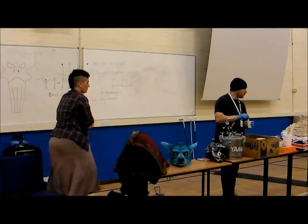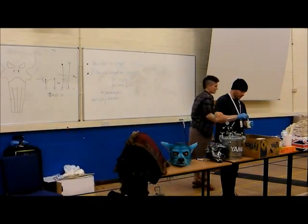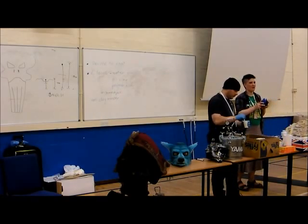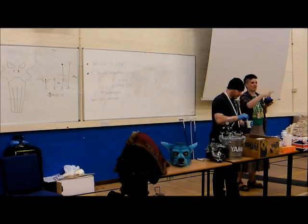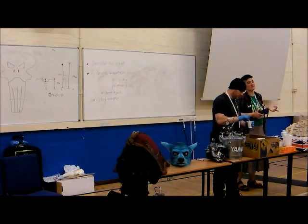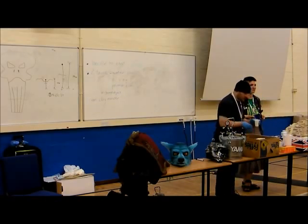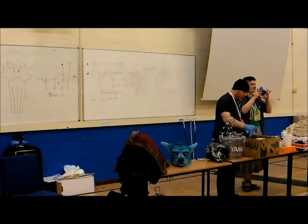We'll show you again the respirator. This is a twin filter respirator. We use the round cartridges, which are actually quite hard to get hold of. A lot of the time they have these oblong cartridges, which you can get at hardware shops. Some do, some don't. There's a proper machine shop, and builders merchants, because they use them for painting, that sort of thing. I've got a single filter that I don't store properly because I only use it for solvent-based glues, which aren't quite as nasty as some of the resins. But this is our twin filter.